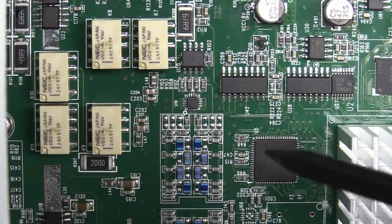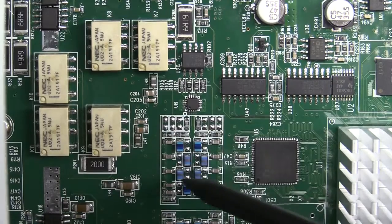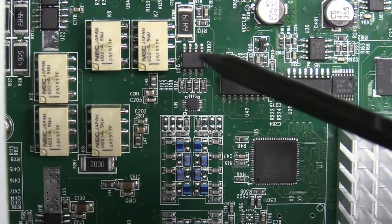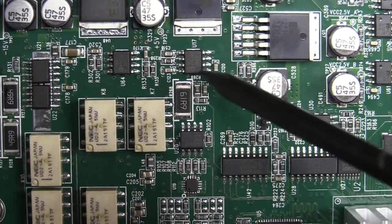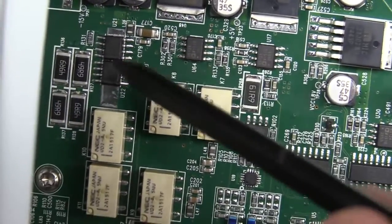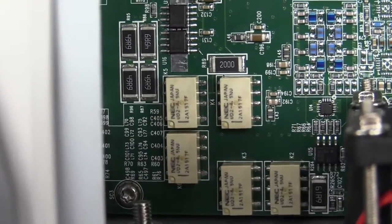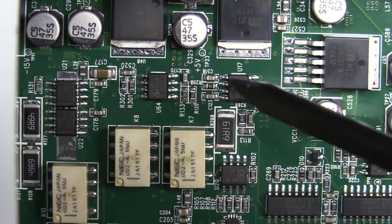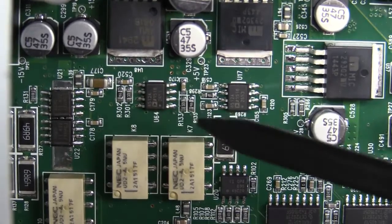So clearly what's going on here with one channel: we've got our DAC — this is a current output DAC by the way — then there's a massive anti-aliasing passive network, then what has to be a current-to-voltage amplifier, then the real high bandwidth voltage amplifier we looked at. Then probably some DC offset functionality happening, and then the two output drivers. That's duplicated exactly on the second channel as well. I checked — these two puppies are AD8512As — just some low noise JFET op-amps, almost jellybean parts. As I suspected, most likely doing DC offset functionality.